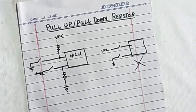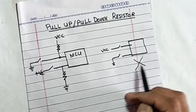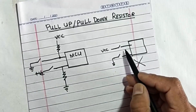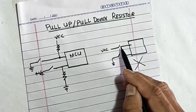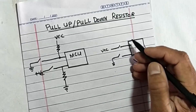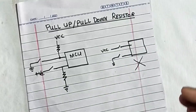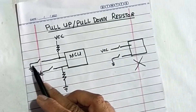The microcontroller is a very sensitive circuit. Its tracks and wiring on the PCB are very close to each other. Sometimes we have multi-layer tracks — four, six, or even ten layers. There is electromagnetic induction: when this pin is open, from the switch to the microcontroller pin, this track is open and electromagnetic induction will induce some voltage, which can interrupt the microcontroller and cause false switching.